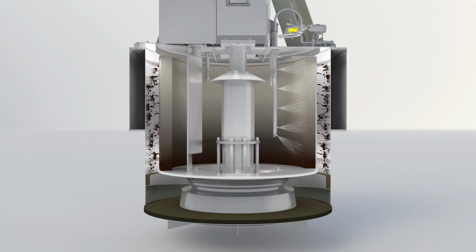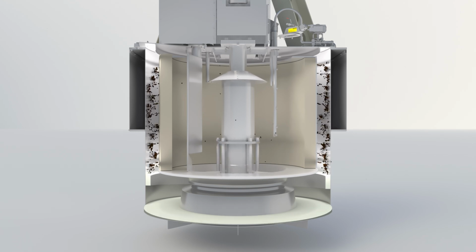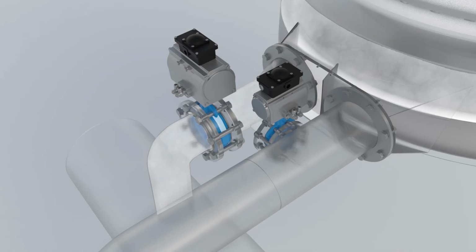During the acceleration process and before reaching the maximum speed of the centrifugal, the evacuation of the syrup will reach the surface of the cake formed on the wall of the basket, causing a color change on this surface. This is the exact moment to apply the washing water to the remaining sugar in the basket. This process can be done automatically in our centrifugals, as we will explain later in this presentation. When applying the water, we will be dissolving an important quantity of sugar, and therefore, after a short delay, it is the moment to change to white runoff in order to take advantage of this product in the process. This configuration can be seen on the screen.